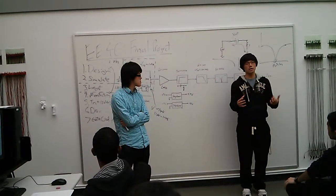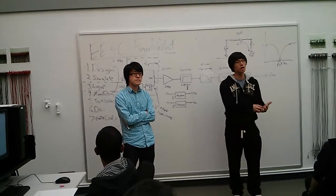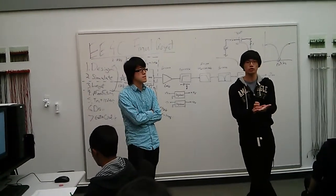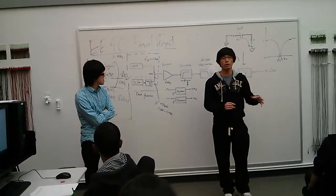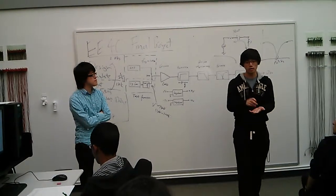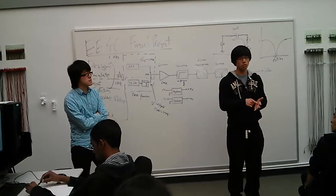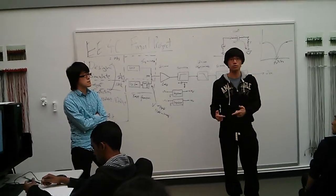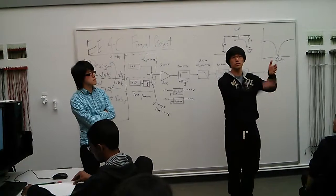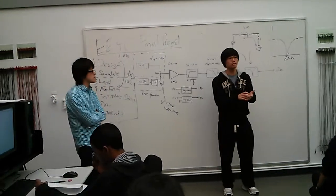Basically what a footprint is, you have these components, like resistors and capacitors and op amps that you're putting into the Multisim simulation. But the ones that we've been using are just generic resistors, so they don't have a manufacturer or a tag. But in reality, when we take this to the manufacturer and print a PCB, we want it to be fine-tuned, so that when we simulate this Multisim circuit, we simulate it with the components that we're actually going to solder into the board. Even for a single resistor, there's a bunch of different types of resistors manufactured by different companies. And we want to pick the footprint, the tag of that resistor, to match whatever resistor we're going to use.